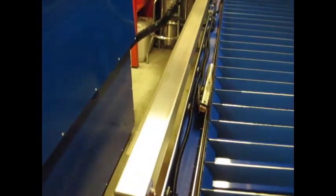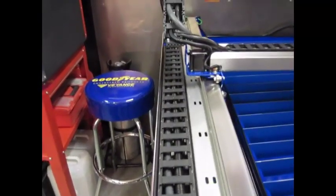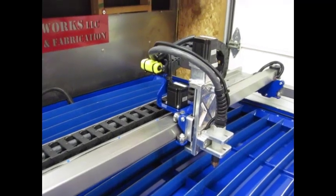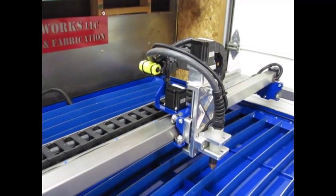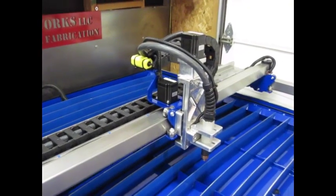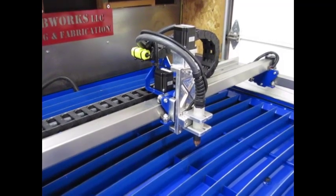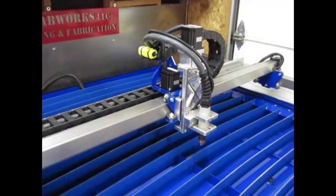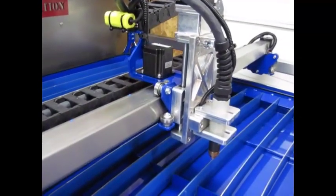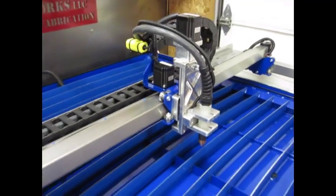The rails are all stainless steel. They have stainless steel supports down the side for running our cable track. On the center here, this is our Z-axis. We did a couple of things so we can be prepared for the future — the yellow plug up there is a 110V electrical plug for the option of using a router down the road. They ship this Z-axis with both a router attachment and a machine torch attachment, so we can easily switch it out and go to a router, making this machine very versatile — we can do wood, metal, and various other things with the same equipment. This is a floating torch head design. You can see the wire running back behind the micro switch, which helps with our torch height control and finding our zero point on the sheet metal every time for the cuts.